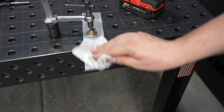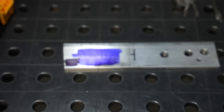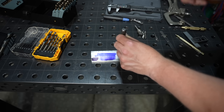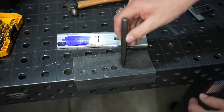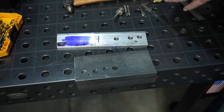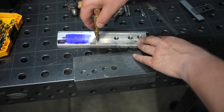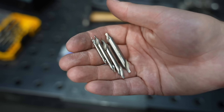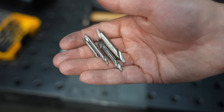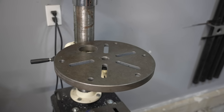All of this just wipes off with some acetone after, so you don't need to worry about it on your projects. Once it's marked out, center punching is essential to hit your position and keep your drill from wandering, especially hand drilling. I use these center punches — just the old-school style 90-degree point — and that works pretty well on aluminum, steel, and other metals. There are also automatic center punches you just press and it clicks to make your dimple, but they can slide around a little, so I like the old-fashioned ones better. I'll also mention center drills — rigid drills that make a little indentation — but I mostly only use those for machining.